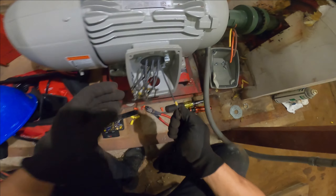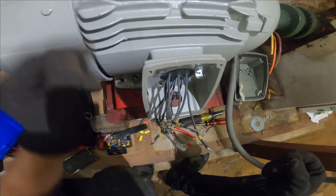Looking at our diagram, it shows that 4 and 7 go together, 5 and 8 go together, and 6 and 9 go together — and that's going to be wired internally within the motor. We also have 1, 2, and 3, which are our three phases coming in from main power that get connected to those wires. Let's begin by wiring the motor internally. For high voltage, 4 and 7 go together. Each wire has a little yellow label with a number representing that part of the winding.